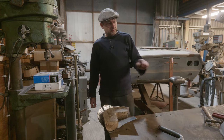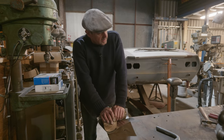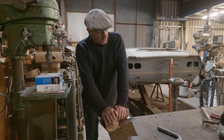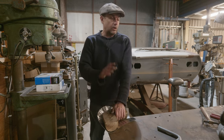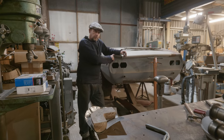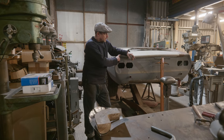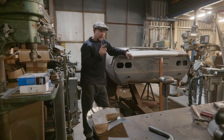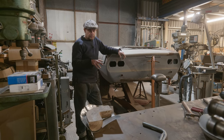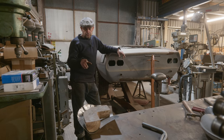A lot of effort doing this way. It's not the best way of doing it. Pressing it would be the best way of doing it. But obviously, you know, we haven't got that opportunity. And as I quite often say, these things were all built with press tooling, but then hand assembled at the Pininfarina factory. Whereas the Maseratis and other things were hand formed. So, you know, when you're hand forming things, which is what this is, you try and find the most efficient way of building something.